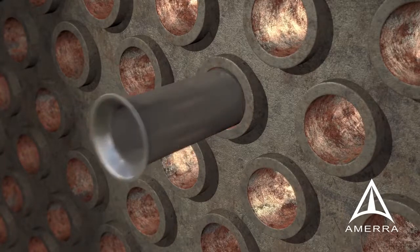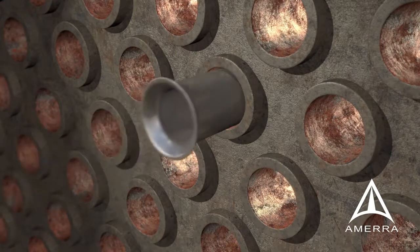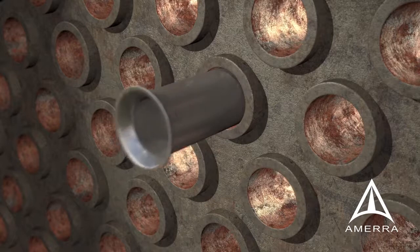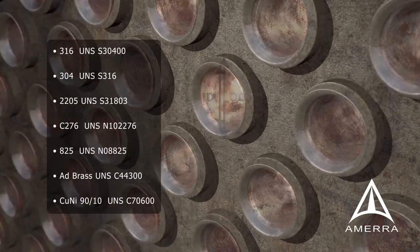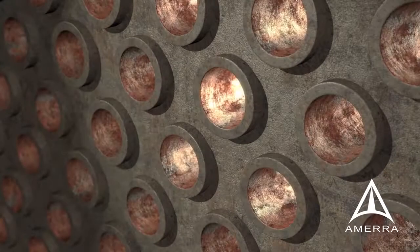The installation of a full-length liner or a tube end insert to repair an in-service tube can restore years of operating integrity to the exchanger and is a proven, reliable maintenance practice. Curran International will consult with the client to review existing operating conditions, confirm dimensions of the existing exchanger, evaluate repair liner alloy options, then expertly install and hydraulically expand partial and full-length repair liner.